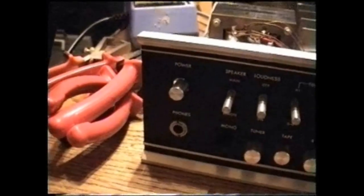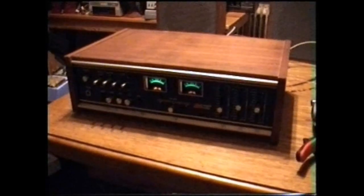Hear that pop noise there? I built in this little capacitor here — it's just something below 1 microfarad. This prevents sparks inside the switch. That's a nice little thing. If you install it, it will protect your speakers, because if we now turn off the amplifier — silence. In today's units you'll always find a capacitor like this, at least if you have a real power switch. But back in the days that capacitor wasn't common, so it's always a good idea to put something like that in.